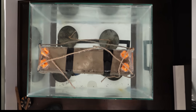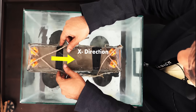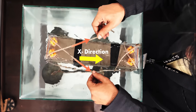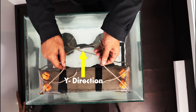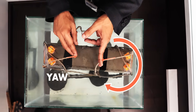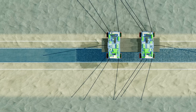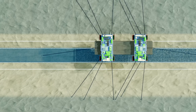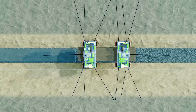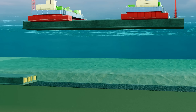We have made a simplified web of cables to control the position of this floating object. Just by pulling these cables, I will be able to move this object in the x direction. To control the y direction, just pull these two ropes. With this clever mooring rope control, the element is carefully positioned over its final resting place. The pontoons receive position signals from the GPS and robotic total stations.